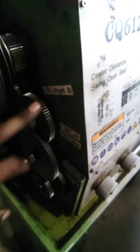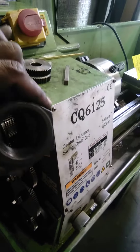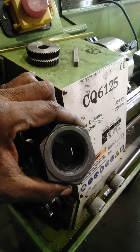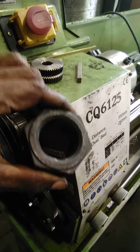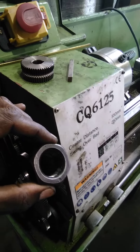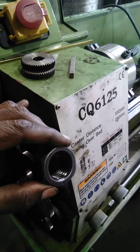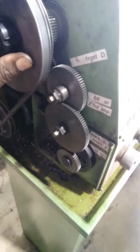Nice little project, just getting myself more familiar with the gearing on this little lathe because I want to cut — this is an inch and a half UNF nut, inch and a half 12 TPI thread — and I want to cut a 1 inch 8 TPI thread, so I've got these nuts to act as thread guides, thread testers.